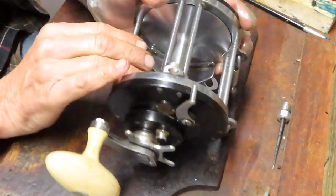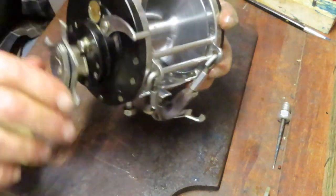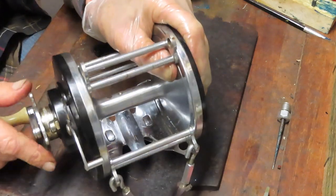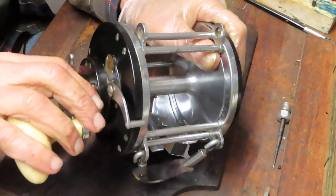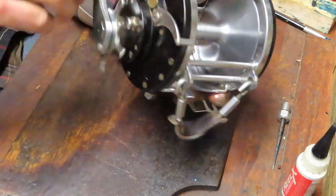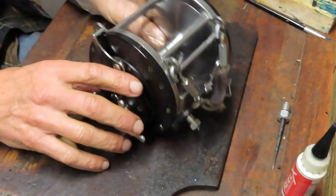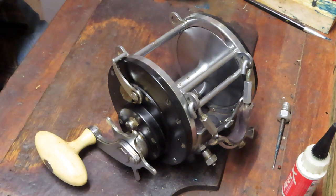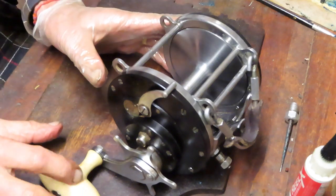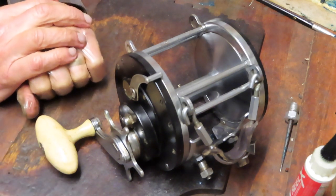We should be in free spool right now - let's see how that does. That's a beauty. Let's go ahead and put it over to the drive side so we can bring the fish in - and that is a nicely, evenly working reel. Tighten down the drag to make sure we've got drag hold - we sure do. Back it off to make sure we've got some fighting capacity - we do. I recommend leaving the drags off unless you're actually out on the water fishing. So that's it: the Ocean City big game 609, made somewhere in the early 1950s and selling for about $35 at the time. If you've enjoyed that, please like it. If you want to see more, please subscribe. If you have questions, leave them in the comments. If you have a reel that needs repair or service, contact me at the email on the business card that follows. This is Dennis with Second Chance Tackle - have a great day.